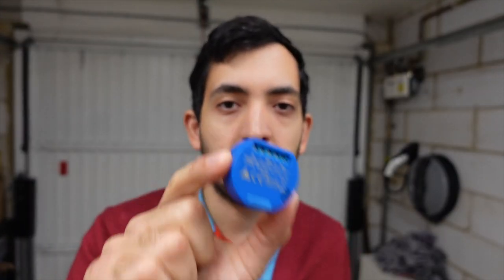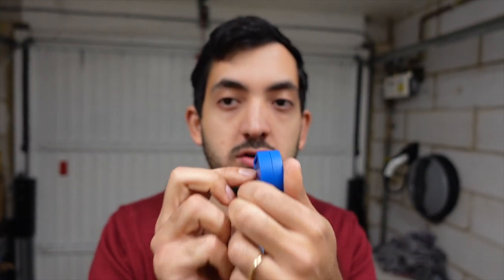This Shelly device connects over WiFi, so you're going to need good WiFi coverage wherever you plan to install it. Bear in mind these are normally in enclosed enclosures and depending on the type of enclosure, it can be problematic and you might not get a WiFi signal to the device. In my setup, I got an access point downstairs and created a specific SSID that I only use for these devices, so I always know they're going to connect to the same access point.